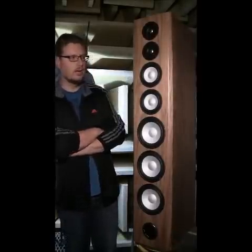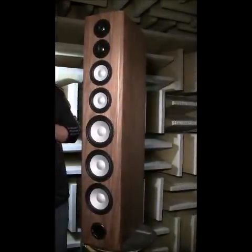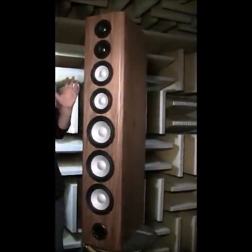The challenge is that unlike the LFR 1100, where we have a lot of cabinet volume to get decent low frequency output, when you get down to a very small cabinet and you have to have drive units on the front and back to give you the omnidirectional radiation pattern, the cabinet volume per woofer gets eaten up by the drive units themselves very quickly. So it's very difficult, if not impossible, to make an extremely small, compact speaker that's omnidirectional.